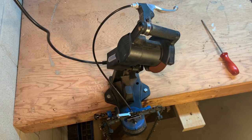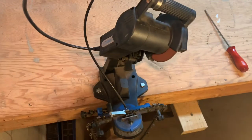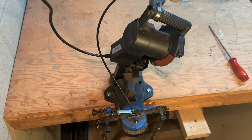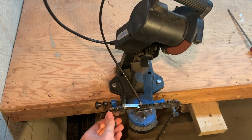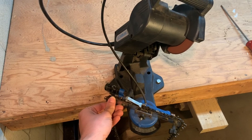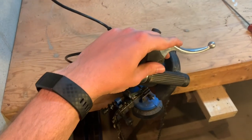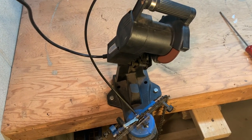This machine here is a benchtop electric chainsaw chain sharpener. This specific one is made by Bluemax — I bought it from Rural King for $20 on sale. They're about $40 right now, but if you go to Harbor Freight, you can get the same thing branded as Chicago for $30. I'll put a link for both machines in the description below. What makes this machine so special is that you can set your angle of cut — 30 degrees for your right teeth and 30 degrees for your left teeth — and then this spinning angle grinder sharpens each tooth at precisely the right angle, taking all the guesswork and human error out of the equation.